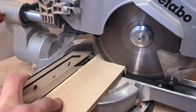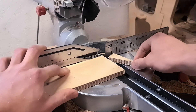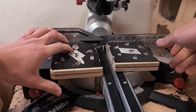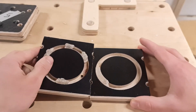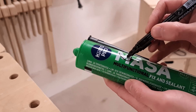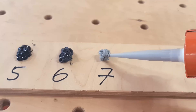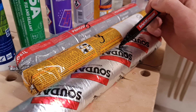Which turned out to be way more challenging than I anticipated. To make it easier I cut some small plywood wedges. However I soon realized it might not be possible to separate all five molds simultaneously, so I tried separating each section with a miter saw — but that didn't help much either. In the end I only managed to get two of the molds open, and in the process I broke the rubber wheel in half. For the second test I decided to squeeze a little bit of each sealant on an offcut piece, so we could learn the characteristics of each sealant and select the ones that would better serve as the wheel rubber.